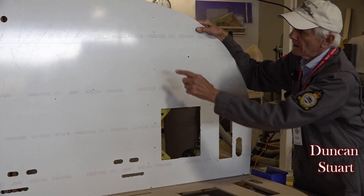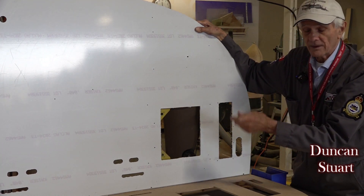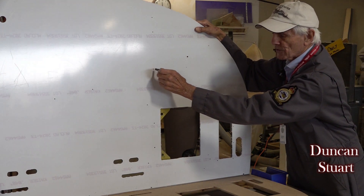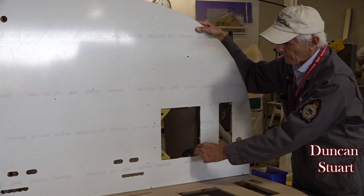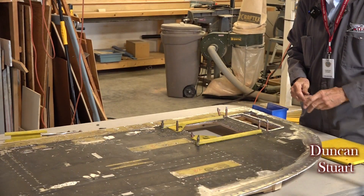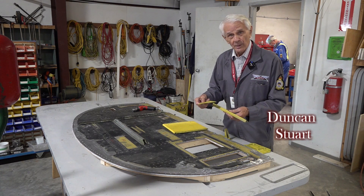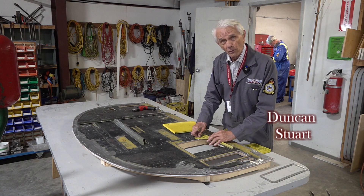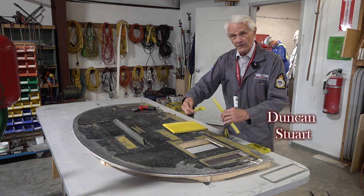As you can see, all of these small holes were drilled to match the existing bulkhead stiffeners. They will be used to put temporary fasteners in position to hold the stiffeners while we drill the rest of the holes. We were able to router all of these holes to match the existing bulkhead. These are items which we have already cleaned and painted — they would originally have been in this position on the old bulkhead, but underneath we have the brand new one which will now be match-drilled with these items.